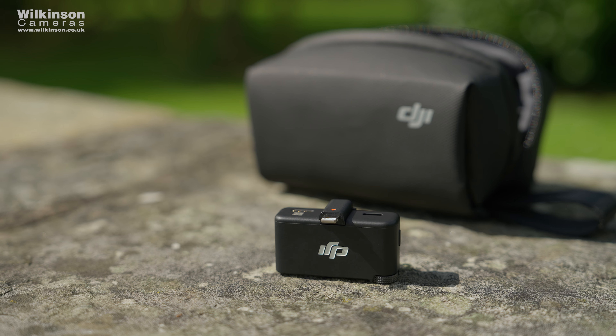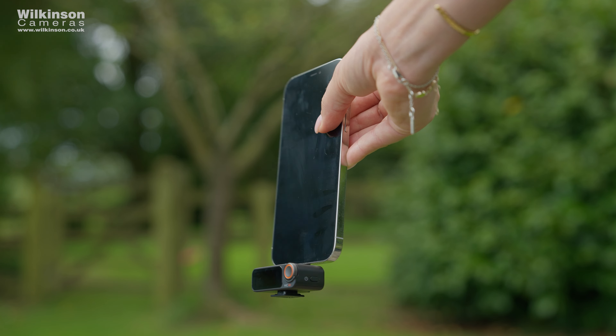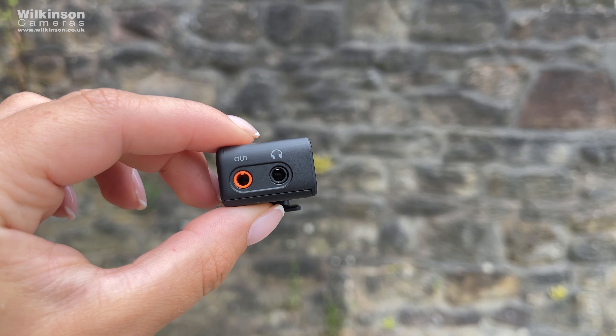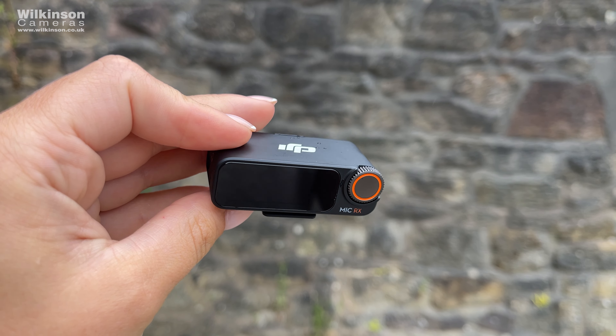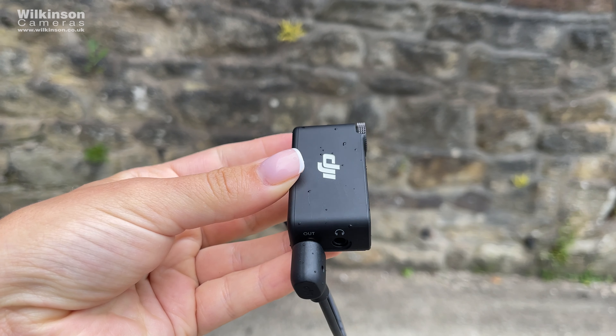But what if you're not recording from a camera? No issue. The DJI Mic 2 offers extensive compatibility options including USB-C and lightning digital outputs, as well as the 3.5mm TRS analog output. Stereo functionality is available for iPhones and most Android phones, allowing for playback on a smartphone without disconnecting the receiver. The receiver also includes a dedicated 3.5mm TRS monitoring port for real-time audio monitoring with headphones.